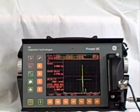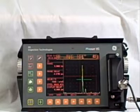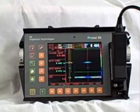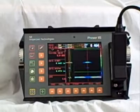We can contrast that to the image of the same block seen by the array in the previous image. Next, I will switch back to phased array mode to show you a special feature of the Phaser, where we can use the phased array image to measure the thickness of items like corroded pipes. In this image, you see the picture of the same block scanned before, now using a zero-degree array with coverage up to about two inches. You can see in the center of the screen the defect as well as the thickness — or the distance that defect is from the top surface of the material.